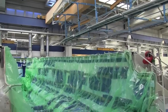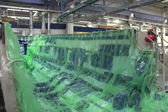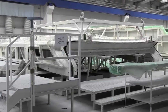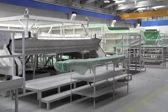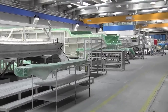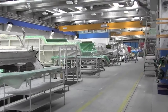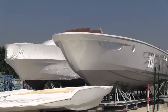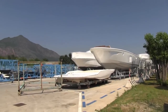Vacuum infusion is easier in a certain way. It consists of stacking all the fiberglass at one time — you dispose all the layers with the orientation that you need. Then you cover the stack over the mold and cover the layers with a peel of nylon. Then you insert over the nylon the different injection points, based on the distribution of the resin that you want to get.